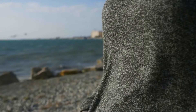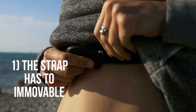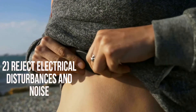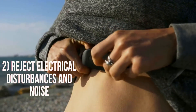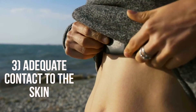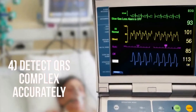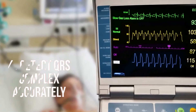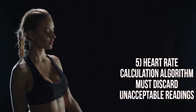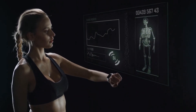There are a number of issues which can hinder accurate ECG readings. First, the strap has to be immovable. Second, the strap must reject electrical disturbances and noise from entering the electrodes. Third, the electrodes on the strap must provide adequate contact to the skin. Fourth, signal processing has to detect the QRS complex accurately with sub-millisecond resolution from ECG signals. Fifth, the heart rate calculation algorithm must discard unacceptable readings but allow rapid reaction to changing heart rate.